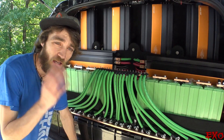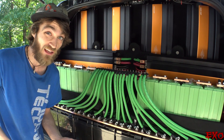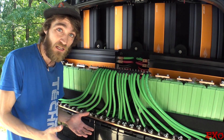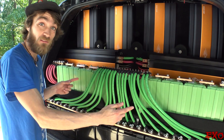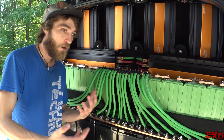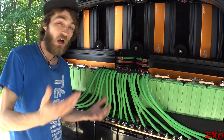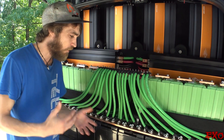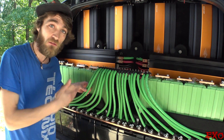Some people wondered why I have so many wires right here. Is it just for looks? Well, let me break it down a little bit. These batteries have the ability to supply what those big AGMs do. Almost all those big AGMs are equivalent to just these two banks of green batteries you see here. So in order to safely supply and get what we paid for out of the batteries, you need lots of wire. Each one of these wires can handle 300 amps on the low end — they can handle 300 amps going 50 feet. That's what they're rated for. So let's count these up.